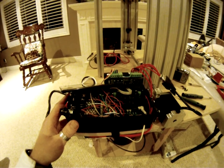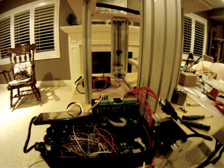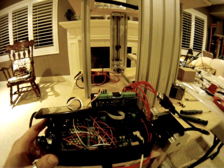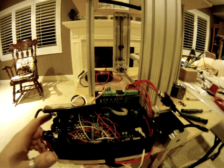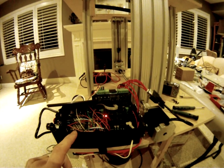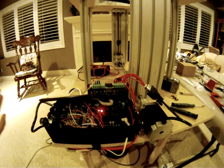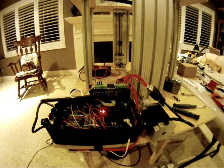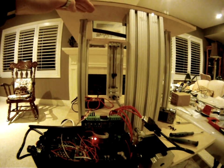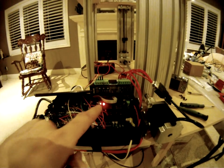When I press the start button, the motors will turn the screws and the platform — which isn't bolted up yet — will move into the down position. You'll see the indicating LED turn on, saying that the heater is turned on at this point. This would be heating up the plastic, and then once the plastic has been heated, the platform will be moved up to press the mold into the plastic and the LED will switch again.